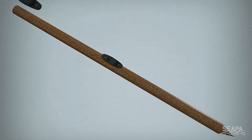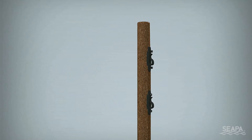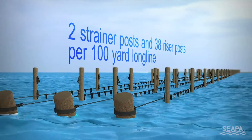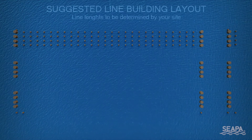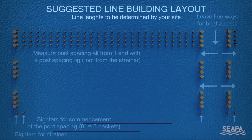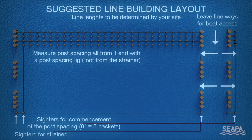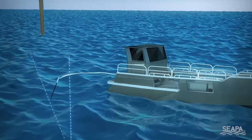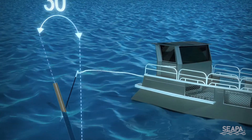Prepare the infrastructure on shore prior to installation by screwing post risers onto the posts. These should span the lowest and highest tide heights with at least one middle riser. Mark out the line orientation and length using sighter pegs across the farm site. Using a string line, peg where the strainer post will be located at each end of the rows. Embed the strainer post into the sea floor until firm at each end of the rows using a water jet, then leave for a few days to settle.